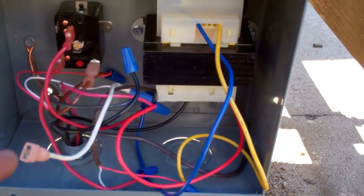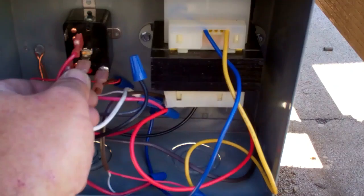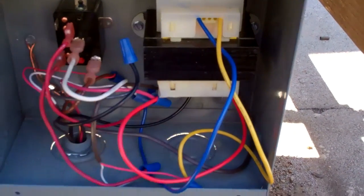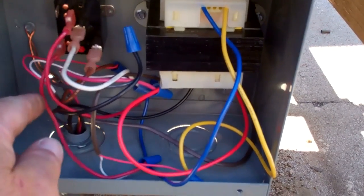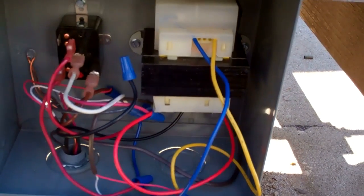On a call for cool, the thermostat is going to send 24 volts to this relay. Contacts 2 and 4 close, sending power from this transformer into the main contactor — and that's how I got it sorted out.